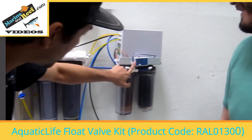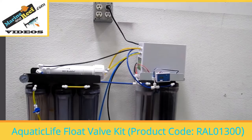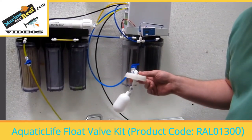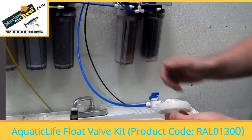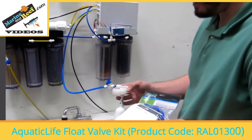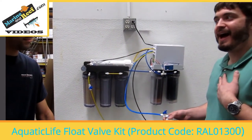What does this gauge do, and what is this little meter here for? These are some of the common upgrades you're going to see in RO systems. Some of the more expensive systems have the pressure gauge and a TDS meter, and if your system doesn't have them you can always add them on later — which is what we did here. To demonstrate these, we're actually going to make some water. We have a cap with a float valve on it — we're going to stick it in our bucket. The most important upgrade anybody could add to any RO system is this little float valve. Aquatic Life makes a float valve kit.